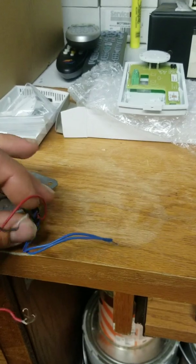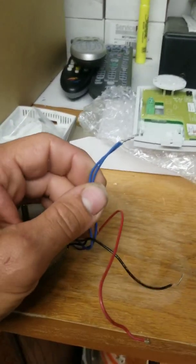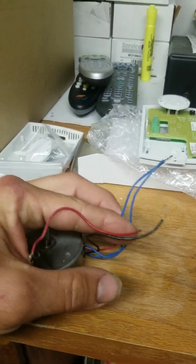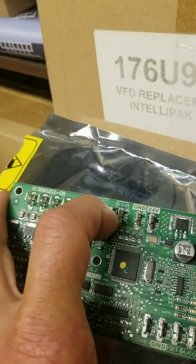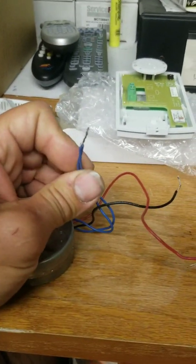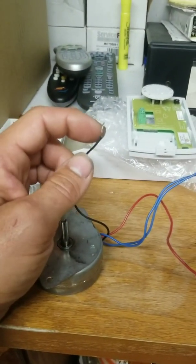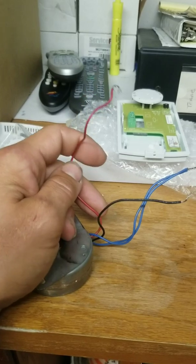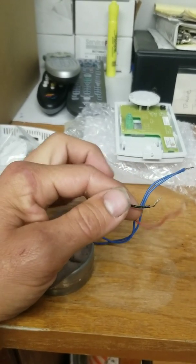As I understand it, this operates off of a triac, which is a little different than what I'm used to. Black is open, red is closed. This actuator plugs into the board where you see 'actuator' on top. It has 24 volts — the common is actually 24-volt power — and the board, depending on set point and space temperature, grounds out either the open or the red closed to connect the common side of the 24 volts.